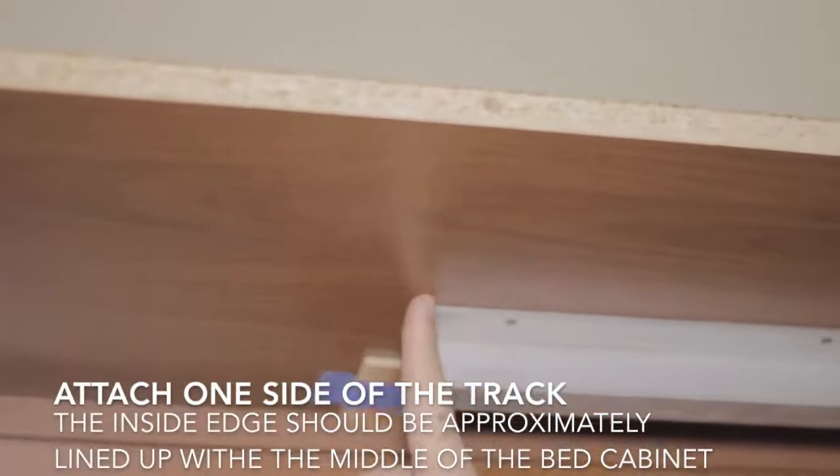You're then ready to add some springs. Hook the bottom hook into the bottom spring bar, get some vise grips that are at least 8 to 10 inches long, secure them just to the back edge of the top hook, and use the yoke connector bar as leverage to stretch the spring and slide it into the hole. This is often more easily done by lifting off to the side of the hole and then rotating into place — we do have a separate video on this on our website. You then attach the actuator arm to the floor yokes, making sure that the nylon washer is between the actuator arm and the floor yoke, and secure that into place. This holds the frame onto the floor yokes, and that bar will extend the legs as you bring the frame down and collapse the legs as you raise the frame up.